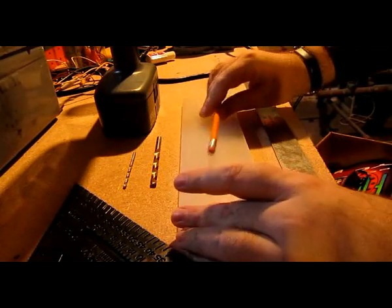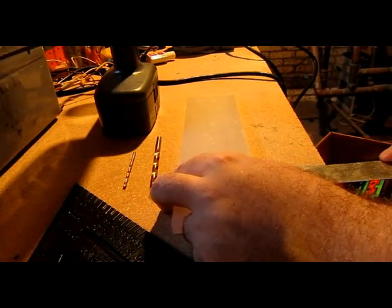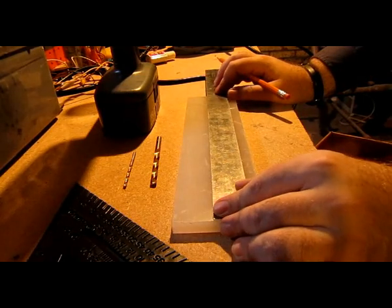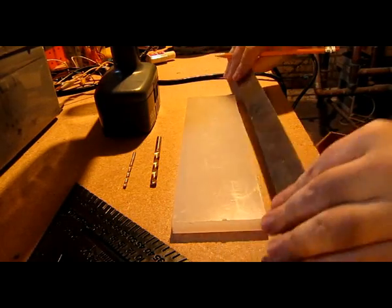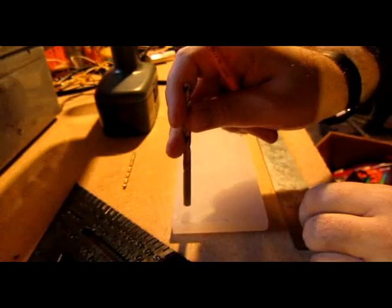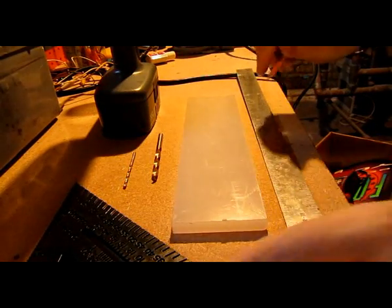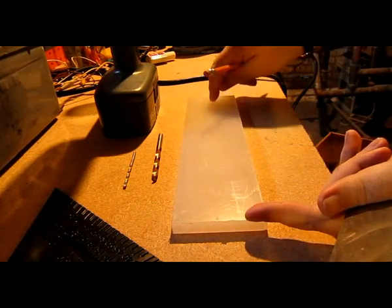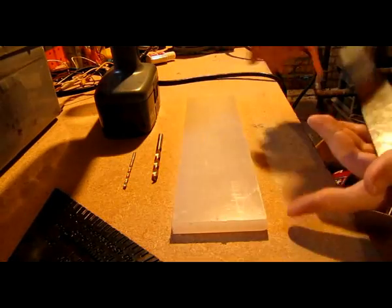So what we want to start with is to see how much material we have. Here we have almost 3 inches high, and the width we have is about 11 and 6/8 inches. What we want to do is have 1 and 1/4 inch holes the same diameter as the pipe, spaced 1 and 1/4 inch apart throughout. We can use this one block to make 4 supports — first find the midline, cut this piece in half, drill our holes, and cut each of those pieces in half. Then we'll have 4 supports.